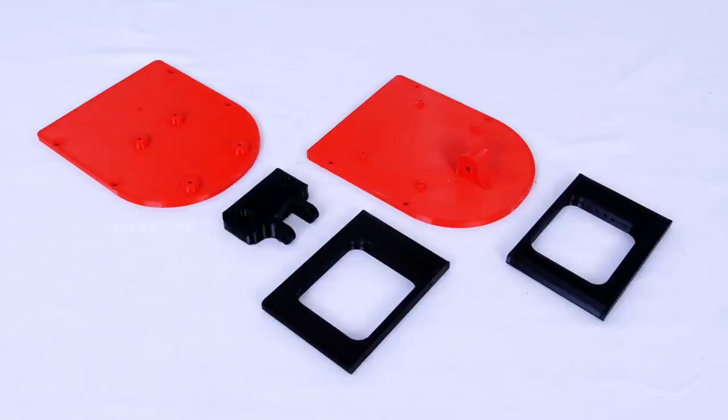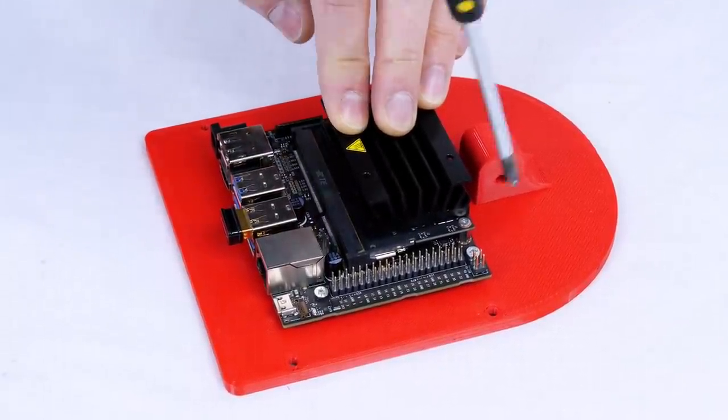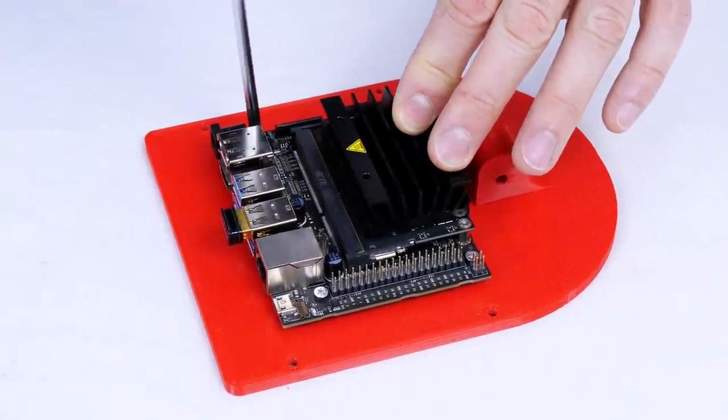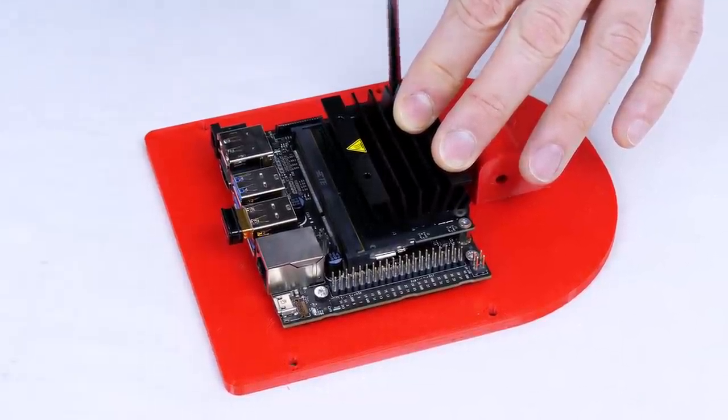I wanted to make the module as compact as possible so we can drop it into any robot that we want to make map and navigate. So this time it resembles a box with a top and bottom and 2 sides that contain everything. The bottom shelf takes a Jetson Nano 4GB version, which is more than sufficient to run ROS. This is a small computer running Linux, which also has lots of GPU for machine learning, and you can check out some machine learning projects in my channel too.